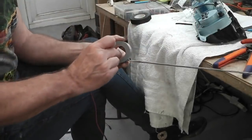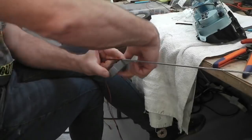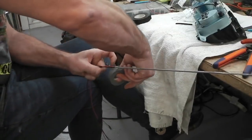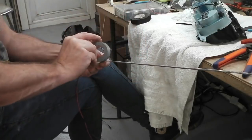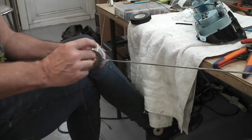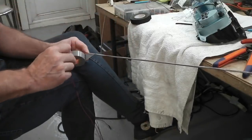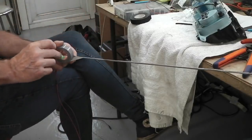I've got the end of the loom locked in my little bench vise, and then I just tension the cable up, and this is the loom tape. You just get that really acute angle here so that you get a nice even coverage. Keep the roll under tension and loop it round, rather than how you would with insulation tape, when you wrap a bit more of a parallel angle. This sort of drags down the cable, especially when you've only got a few cables in. You save your harness tape and it gets a better coverage and a neater finish.